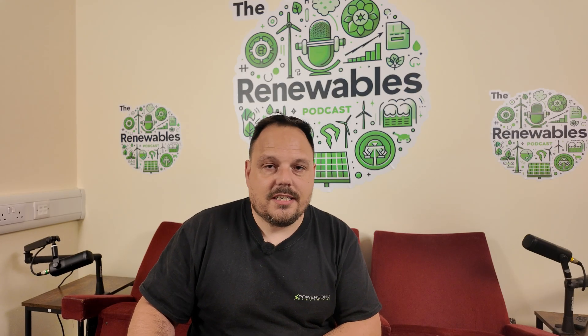If you've got any questions around MC4s and how I've made them off in this video, please drop them in the comments below. MC4s should be carried out by qualified electricians — they're one of the weak points along with DC isolators as the data shows us, and that is usually because they've not been done correctly. You need the right tools and the right person behind them, and you're not going to have a problem with any of those connections — ensuring they remain weatherproof, electrically safe, and protected from critters gives us a fighting chance of having PV systems that will work for the decades to come as they are intended. Thank you very much for watching and I'll see you on the next one.